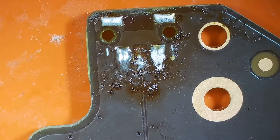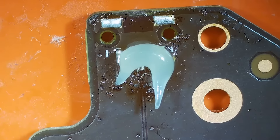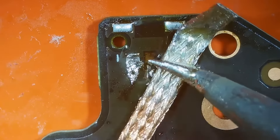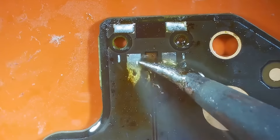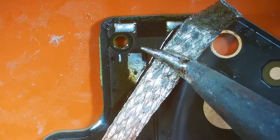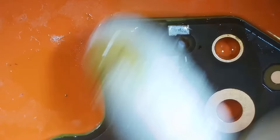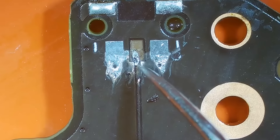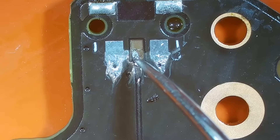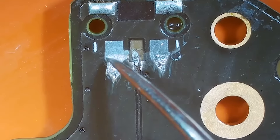I'm going to use some flux — this is just here to help the solder flow. Fume extractor on; I don't want to be breathing these fumes. That looks decent, I think we got a lot of it up. Just need to clean it up so we can have a closer look. It looks like we have one connecting pad right here, this looks like there's a via which goes through the board, and we also have this one connecting right here. This one definitely was not connected before. As far as I can tell, this pad is okay, and I think this pad is okay as well.